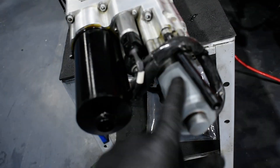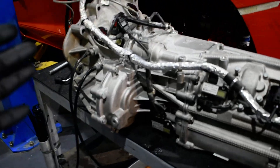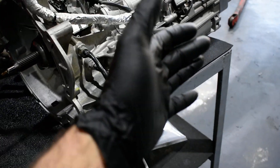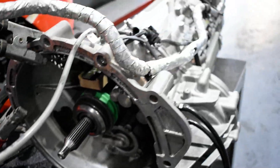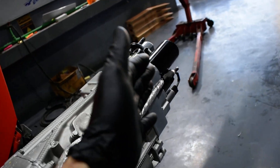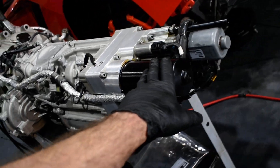I need to check the bleeding again once the pump is working and we can build some pressure on the accumulator. I already bled it — I passed about three to four liters of oil. I had a full bucket with a pump in a closed system and fluid was always coming out. My priority was to get oil everywhere, to have lubrication everywhere, no air in the lines, no air on the clutch release bearing — everything nice and full.